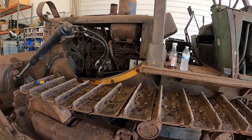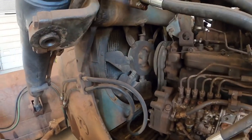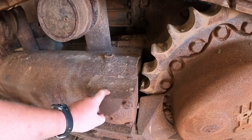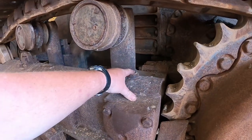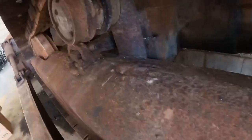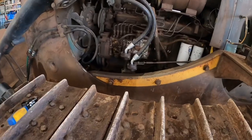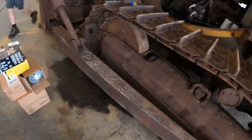These are just good, well-balanced tractors. I started running them when I was nine years old. We've got a few things to do on this one - somebody has bent the fan blade. It's got a reversible fan, but they've tried to twist the blades around or something, so we're going to replace that. We'll give it a complete service, check the final drives. This also has a pivot shaft on it like most of your bigger dozers. The first ones had fiber bushings but they switched over to bronze later. We usually just put grease in them. Low-hour tractors like this - the shims are tight, nothing's worn out.